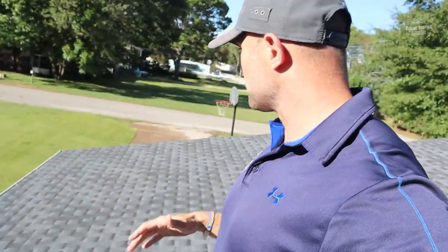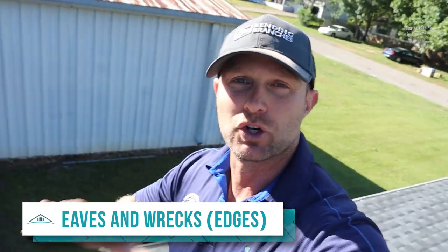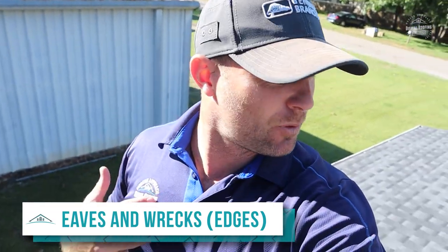Okay, so we're up on the roof right now. I want to show you exactly where you need to make sure that you have your ice and water shield installed. If you're a homeowner and if you're a roofing contractor, I strongly recommend having ice and water shield in those areas. So the first place is you want to have it all along the eaves and the rakes of your roof. You know what eaves and rakes are? It's fine. This is what you got me for.